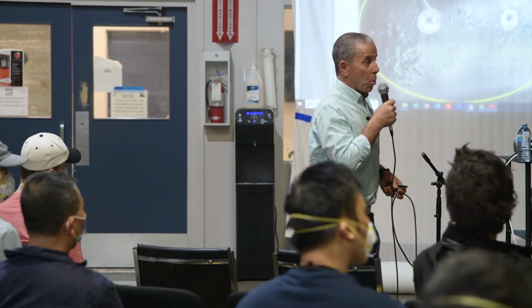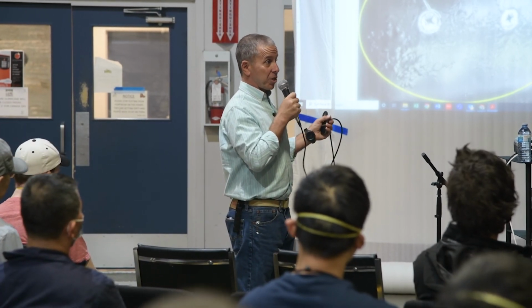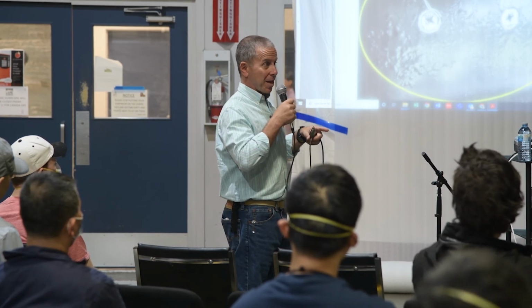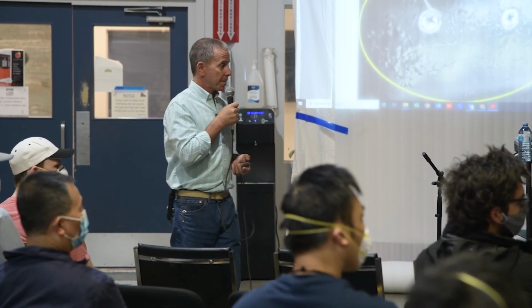Should the Treadmaster get a seal? Well, the question is, should the Treadmaster get a bead around it? If you aren't having failures, don't change anything. If it's working, keep doing it. When I do see failures on Treadmaster, it's because it wasn't glued down well enough or because the surface was contaminated with fingerprints and oil and stuff. If you're not having issues, keep doing it. That's fine.